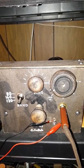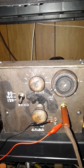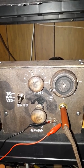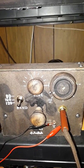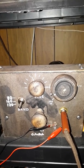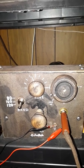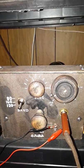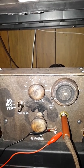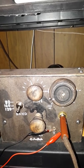The reason I built it, I was interested in seeing if a sliding tube, one tube inside of the other with the coils parallel, would work better than swinging the tickler. And it seems to. This radio, because it has no audio amplifier, really shouldn't have much volume, but it has more than enough for the job.